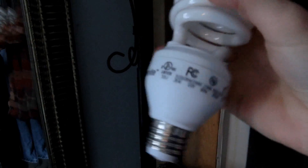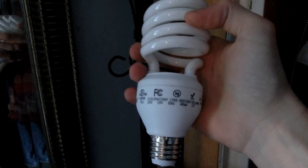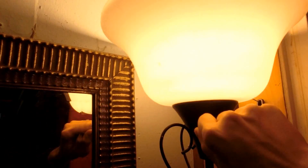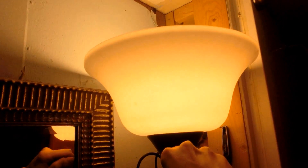It's humming really bad. In the last video we had a 100-watt incandescent bulb, but now we replaced it with a 26-watt fluorescent bulb. Unfortunately, whenever I plug it in and turn it on running off the inverter, it hums really bad. Looks like I'm going to have to find an inverter that puts out pure sine wave instead of modified sine wave, because with this it doesn't work on the first setting sometimes, and the second and third settings are the same brightness with that bad humming sound.